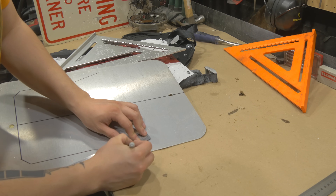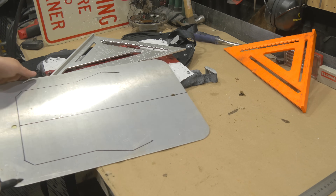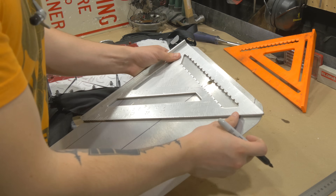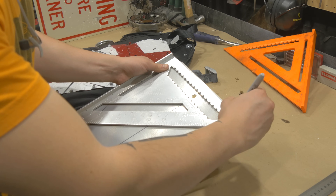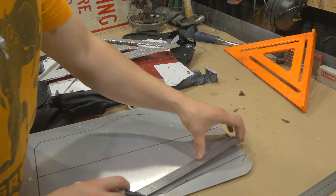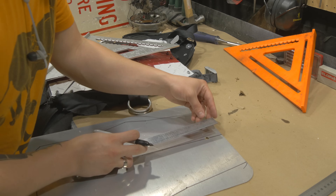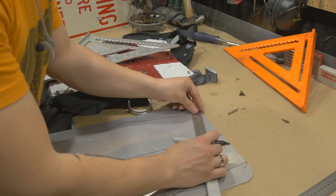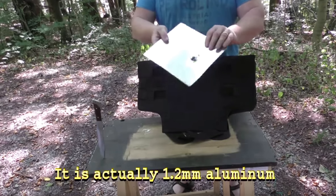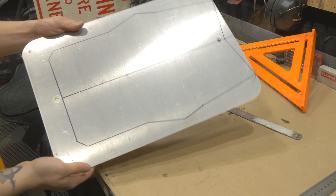Then you just connect the ends of all those horizontal lines and you've got the shape of your plate. Something I want to let you guys know is why I'm using aluminum as opposed to steel. Some people were bringing up on Instagram that Sprov did a video on stab-proof armor made of aluminum, saying that I definitely should not use aluminum. But just because he stabbed through that material doesn't determine whether it's a good material to use — there are tons of different factors to take into account. The major difference is you can tell by the way he's flopping that metal around, it's like a sixteenth inch or less. The aluminum I'm using is a full eighth inch — that's over twice as thick as whatever he was using.